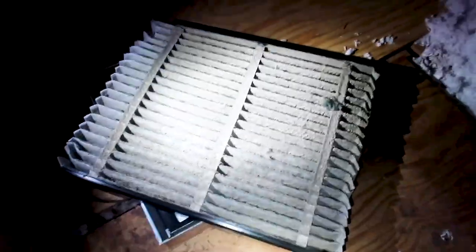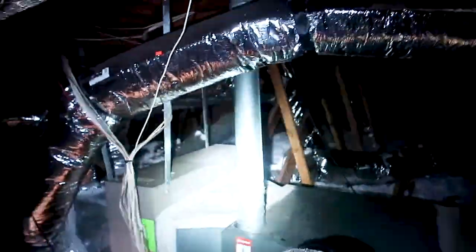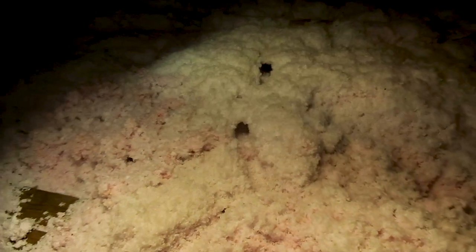Josh identified that the blower is dirty and the filter is really dirty too — that's a pretty common call-out. The two number one things on almost every inspection report from lack of maintenance are: service the AC and repair the roof. We're not rodent inspectors, but you see holes like this — this is a squirrel hole — and you want to at least inform them that they need some sort of pest inspection or pest remediation plan moving into this property.